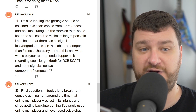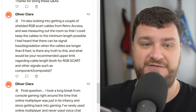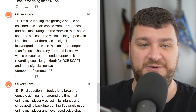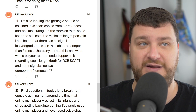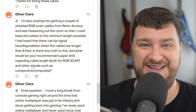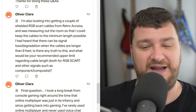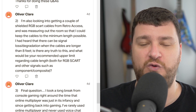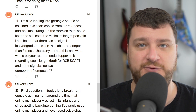To answer directly: keep analog cables as short as possible. If the endpoint is digital, make that the longer cable. If you have a long run of analog, keep consoles to switch as short as possible, and from switch to monitor — if that needs to be the long one — maybe look into linking a couple of HD Retrovision cables together. As far as getting a custom one from Retro Access, if you needed a 15-foot coax SCART cable, I'm sure they'd do it, but that's going to be expensive and rightfully so. You'll have to oversee your entire setup and figure out what's the best move.